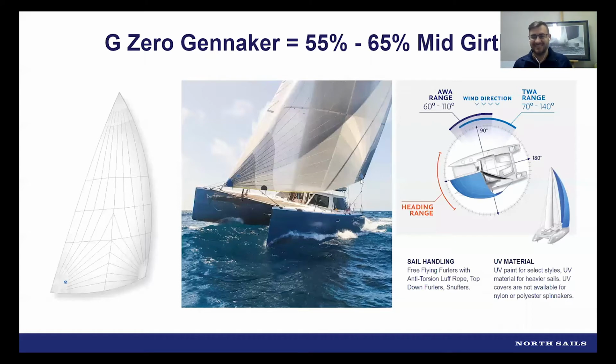I mentioned something earlier about furling and one of the dangers we run into. While people want to leave these things up and furled, never trust your Code 0 furler. I tell people that all the time. They furl or unfurl based on the friction between the furling line and the furling drum. If that line goes slack, or the sail jumps around because the wind gets into a fold up top and starts bouncing it, that drum can skip sometimes. And if that drum starts skipping around the line, the sail could start to unfurl.